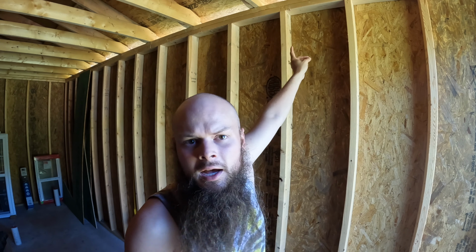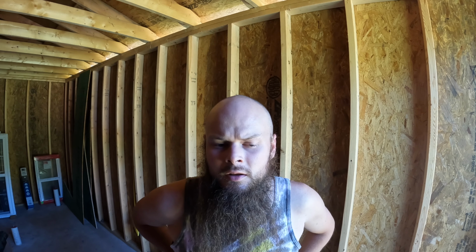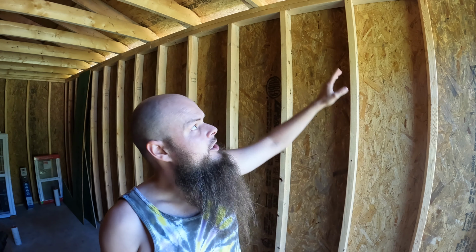So I'm trying to do some basic investigating, trying to figure out where within the wall the windows should sit. Obviously, I can't have them flush with the double top plate because they need a structural header. I believe code says that if you have less than a 3 foot wide span, you can get away with a 4x4 as a header, which is the equivalent of two 2x4s standing vertically. So basically I only need 3.5 inches. I actually need to measure down at least 7 inches from the top of the second top plate.